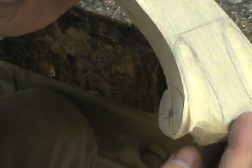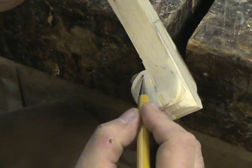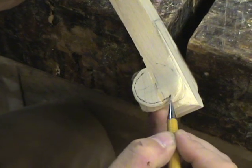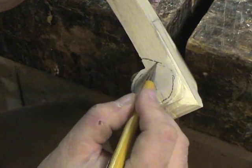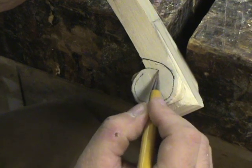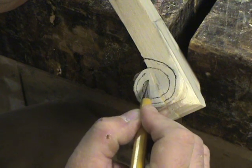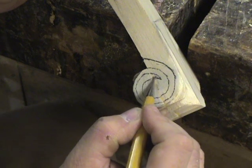You can see I'm just about an eighth of an inch deep, and I've already carved out the top half a little bit with the carving chisels. Now I'm going to lay out where I want the volute to go — basically just eyeballing a round circle about an eighth of an inch away from the line I just rasped with the Shinto Rasp. Just come down and around and keep doing it until it looks right.